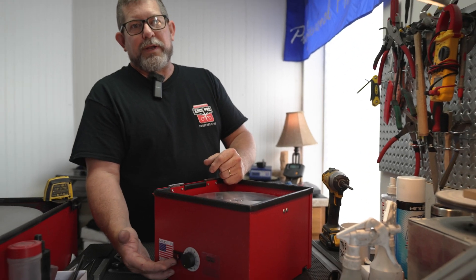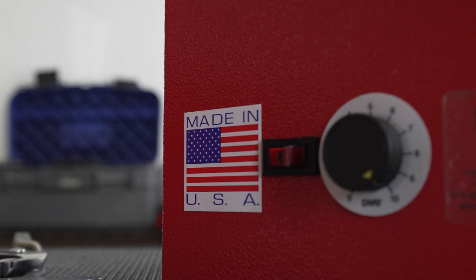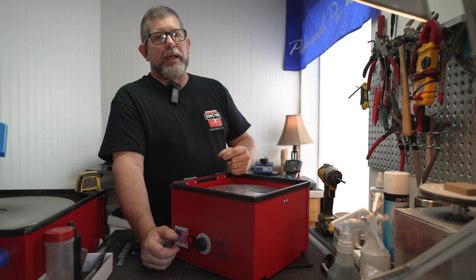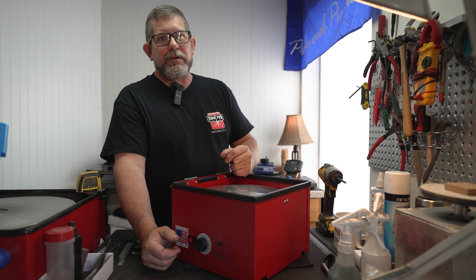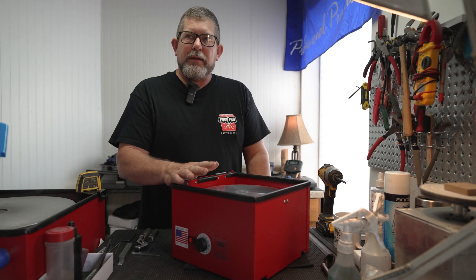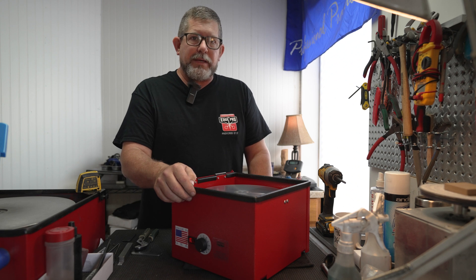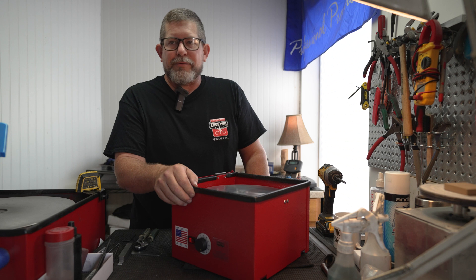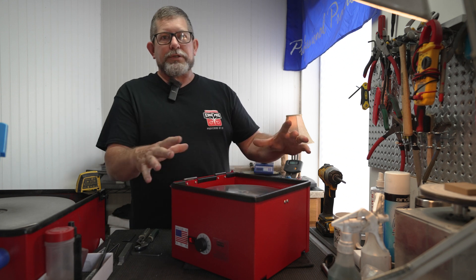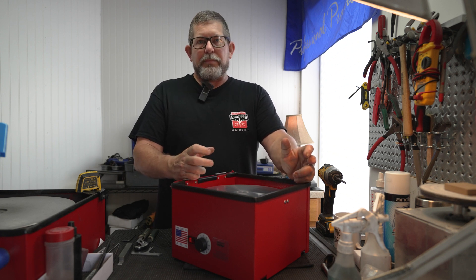There's an on/off switch on the front that's lighted to tell us we're running. We also have a variable speed control — right now it's on the low setting, and as I turn the wheel we pick up speed. We're running right at 900 RPM on the low speed and about 1,900 RPM on the high. These machines are good for sharpening anything from a small trimmer blade all the way up — barber and beauty adjustable blades along with any detachable size blade, including wide blades. The only blades we don't highly recommend on this are horse, cattle, and sheep blades, since those get to three-plus inches and we don't have that much surface area here. For all others — including wide blades for the pet grooming and veterinary industry — they work great.